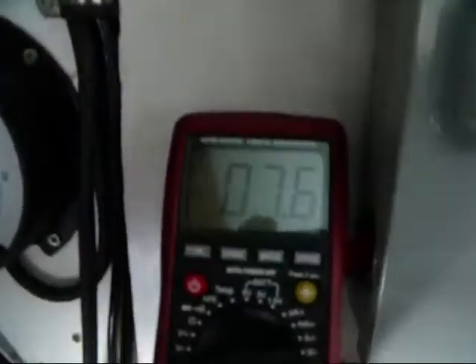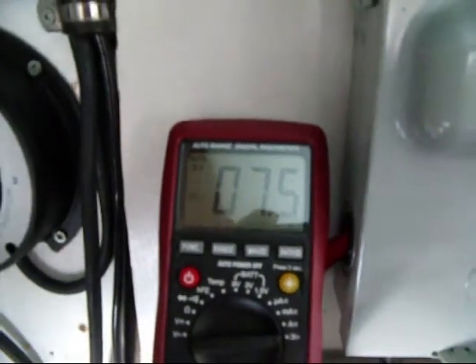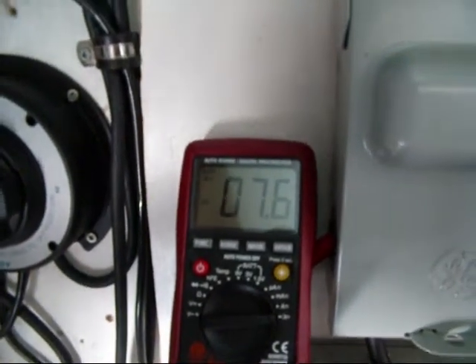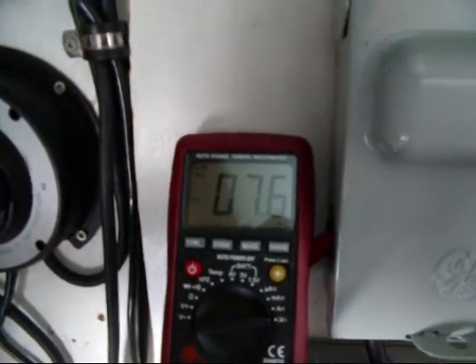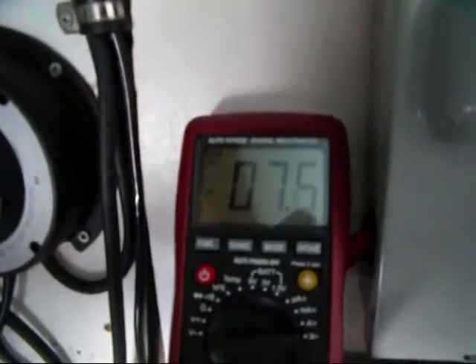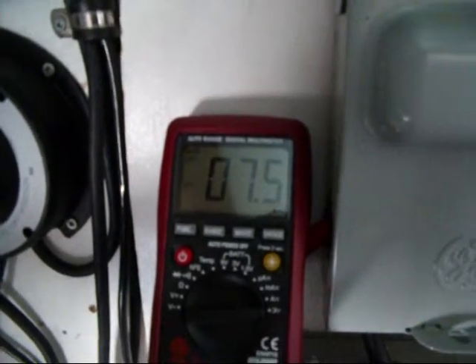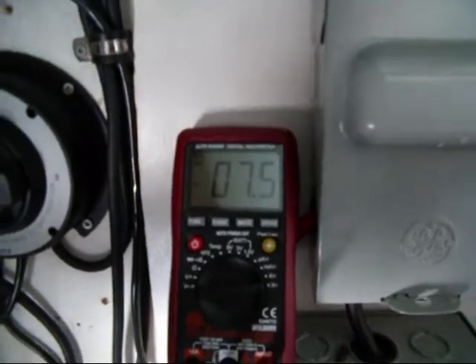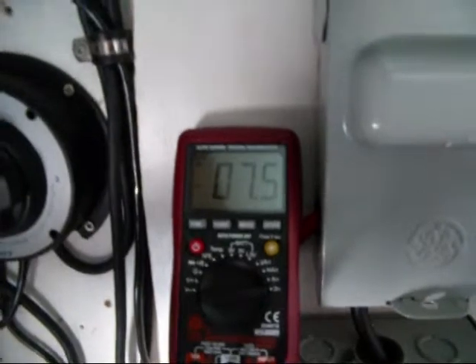I'm getting some good readings — well, I think it's not bad for the first time I can see. Those two right here are the two 125s on the shed roof, but there's a bit of snow on them. They're 37 volts, they're flexible. Both of them together, I'm putting in 7 amps to the batteries with that. The one at the bottom is half covered with snow, so I'll go clean it up later this afternoon.